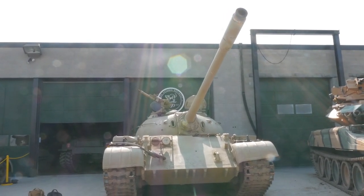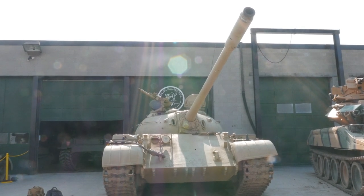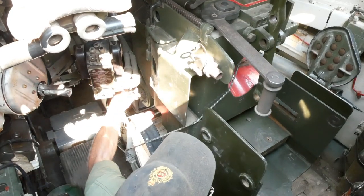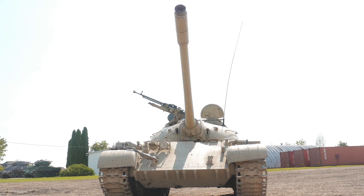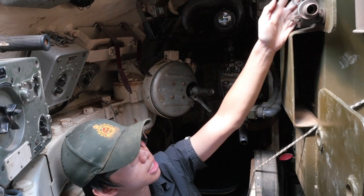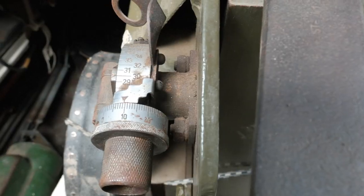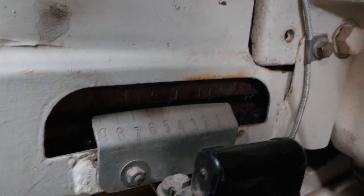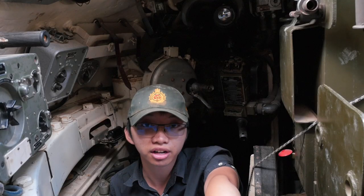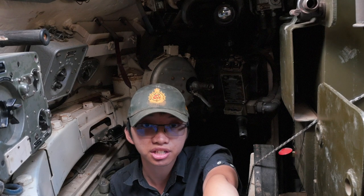Because this vehicle has the electronic elevation, it also has electronic stabilization, making this a T-54A model, and not an earlier version of the T-54, as we presumed in previous videos. The gun itself can also be used in an indirect fire support role. To do this, he's got the elevation markers here and the azimuth over here. In this case, it allows the gun to be fired like an artillery gun, and it can fire shells up to 15,600 meters.